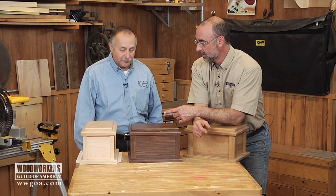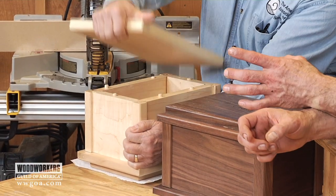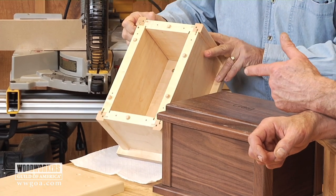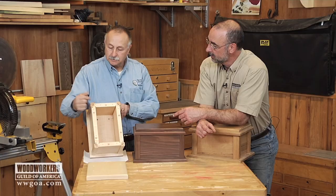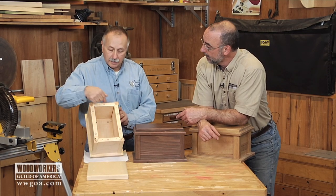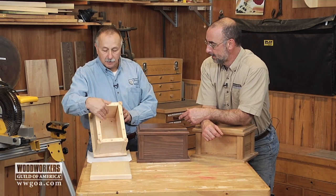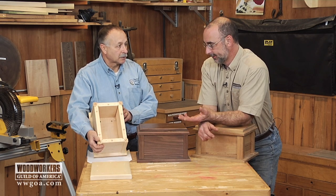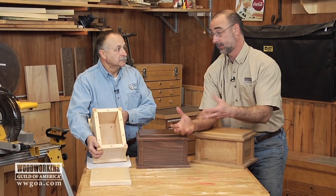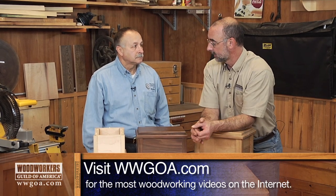Now that maple one — you can take the bottom off, so we can kind of see what the construction's about. It's a neat approach. It's kind of corner pillars with wood panels in between, with the wood panels splined into those corner posts. Pretty simple construction really, but an elegant looking box when you're done. I added these pins for alignment of the base, so there's no way to make a mistake when you're transferring. And unlike something like a jewelry box, you don't want a hinged lid, because once this is sealed up it's going to stay sealed up. There's no compelling reason to get back in there, so the bottom just screws on once it's indexed over the pins and everything is in there.